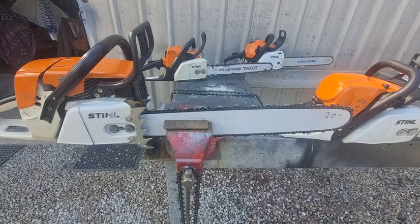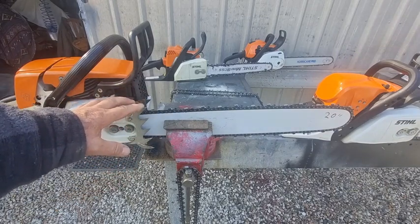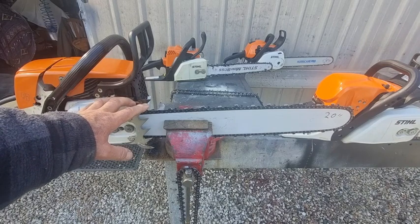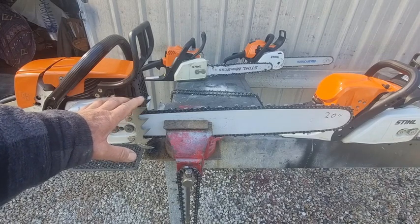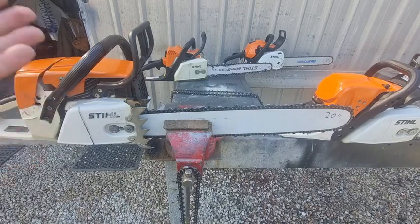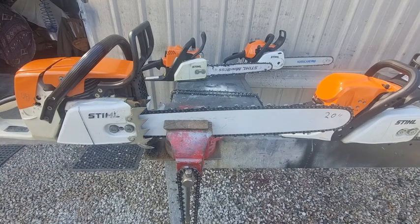In most cases you'll stick with the manufacturer's recommendation. It's only in specific situations — like I had some larger trees on a property and put a 25-inch bar on this saw with a skip chain, and I get away with it. If I were doing 50 percent or more heavy cutting I'd use the MS 660, and I do have one. I wanted to look at medium and lower saws because those are the ones you're more likely to fit a bigger bar on. As you go to bigger saws, they've got the horsepower and grunt — you don't need to sacrifice or worry about fitting a larger bar. It's horses for courses. Bye for now.